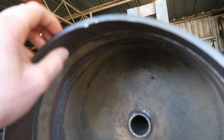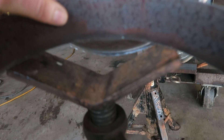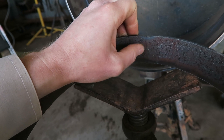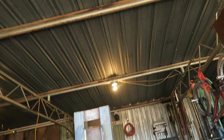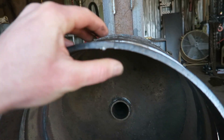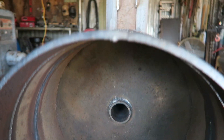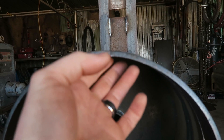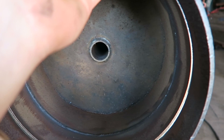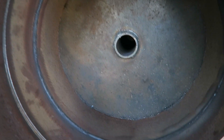A little tip for testing: a lot of this pipe will have a seam. You can run your fingers along it — usually there are two little bumps you can't really see on camera. Pay attention to your seams when tacking your pups up. On test day you'd usually lay out your mud board on two jack stands with one pipe on top of the other. Line your seams up and put them on the top — that way when you go to pull your straps, you don't pull them out of a seam.